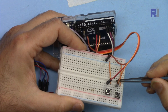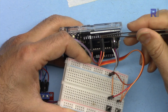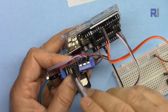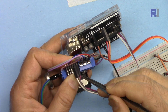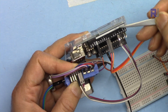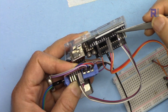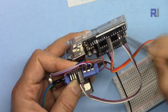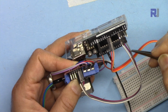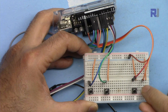For the right push button, orange is connected to pin 8, and for the start/stop push button, red is connected to pin 9. For motor 1, we use three pins. ENA (enable A) is the PWM enable pin, connected to pin 3, which has a PWM tilde symbol. Make sure you connect ENA to a PWM-enabled pin. Input 1 is connected to pin 2 using a gray wire, and Input 2 is connected using a white wire to pin 4.